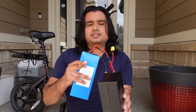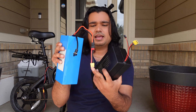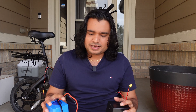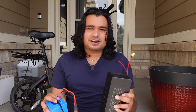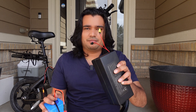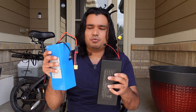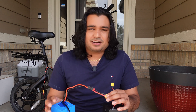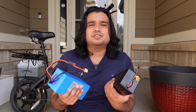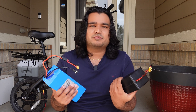There are two cables on each of these batteries: a charging port and a power port. When you connect them in parallel, you are essentially charging both batteries using one charging port, and these batteries are not really meant for charging via the power cable. Only one charger will be used, and they're not meant to be like that — they both have their own charging cords. You also don't know what the BMS, the battery management system, of each battery is, and they could be damaged based on how you are charging or riding.